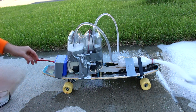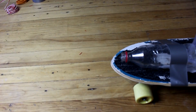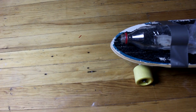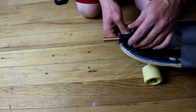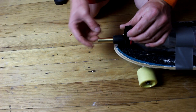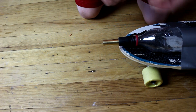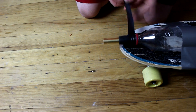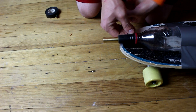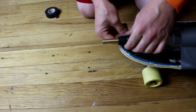It's a little more impressive, but I forgot something - we need a nozzle. A nozzle will restrict the flow, causing the material going through it to speed up. And the faster you can throw something, the faster the recoil and the more thrust. This is just a nozzle off of a garden hose sprayer, and I'm just going to tape this onto the end of the bottle. Yes, I know I'm using electrical tape for this instead of for the actual electrical connections - for this voltage it didn't really matter.